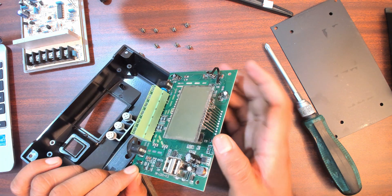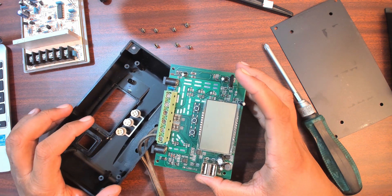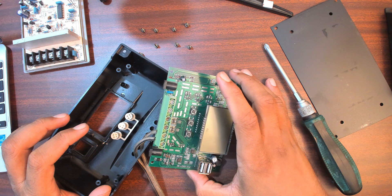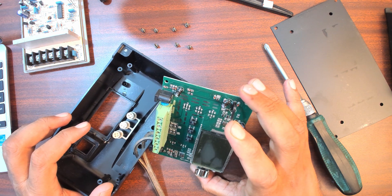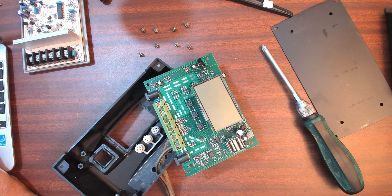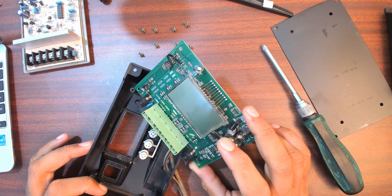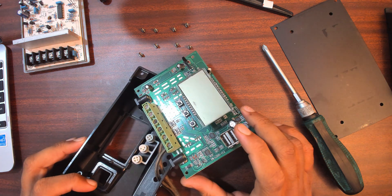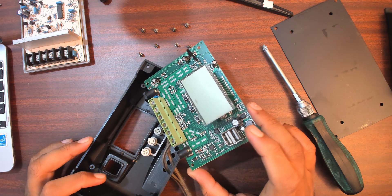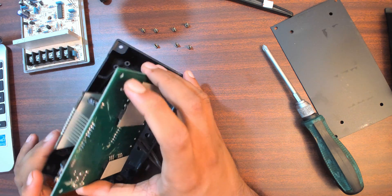There's a microcontroller and an LCD controller in there doing the control logic. The number of MOSFETs makes sense for buck and boost, but the obvious lack of inductors is strange. There's a thermal probe as well. I guess they're just not using inductors, but that seems weird. There are op amps all over the place - at least four of them.